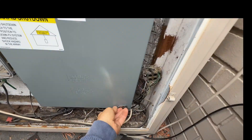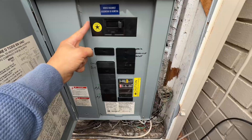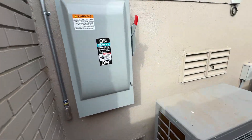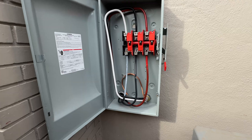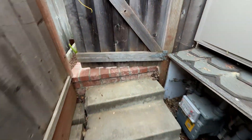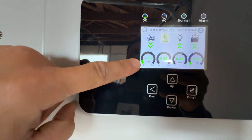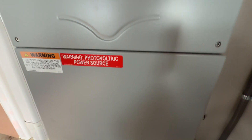Here's the final setup. In the main panel we have a 200-amp circuit breaker, a lug kit, and that's all we have here. Then we have an emergency stop button and the AC disconnect. We switched to off-grid mode right now, and in the AC disconnect we have wires coming from the lug kit and those wires going to the solar inverter. Right now we're getting 239 volts from solar, the house is consuming 800 watts, and the rest is pushed to the battery. We are completely off-grid.